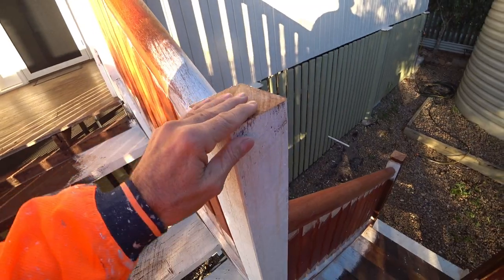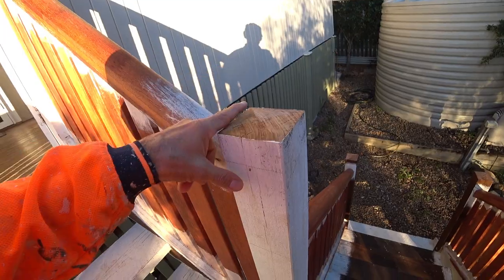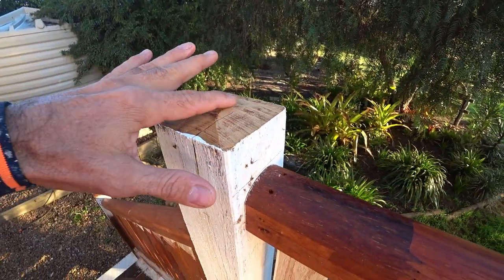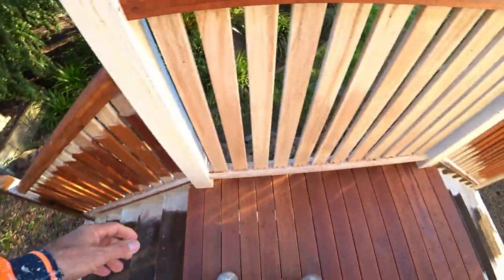Gloss up on the handrails - this colour here will be the gutter colour, which is always your handrail colour. Now you'll notice what they've done here: they haven't just cut them off straight, they've actually got them at an angle - you'll see that's actually raised a bit there, a few millimetres. So when water hits it, it will run off.